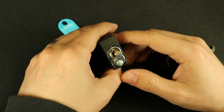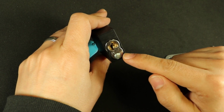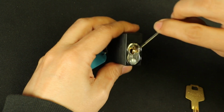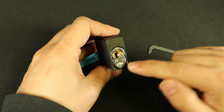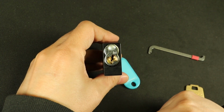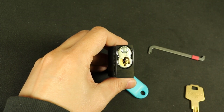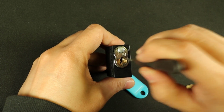Then there's also the 90a-PRO problem, which is similar. If you look at this, people will be like, "Hey, I can't get my key in anymore. The lock is locked. I can't turn it either way, and it looks like it's in the lock position." But again, top of keyway is over here. Your keyway is upside down. So, with that knowledge, you know that the driver pins are actually pushing down. And if you look in here, you can see right here that you have a driver pin into the keyway, right? You can lift that up. You can feel the springiness.